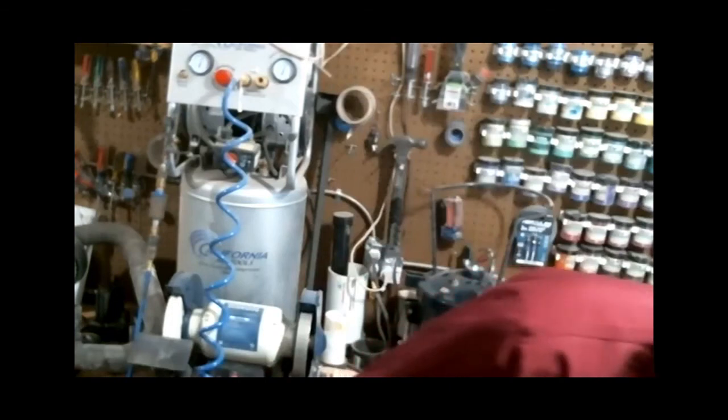If I try to take a piece of green wood that's 40% moisture and do the next step with it, you're going to get all kinds of things happening: cracks, wood movement, twists and warping and everything else going on in your piece. So I let these all sit here for months, literally drying. And when I know that they're down to that EMC, 16%, 17% for me, then I can cut them into smaller pieces that would fit into my mold. For example, this piece would go into one of these blanks.